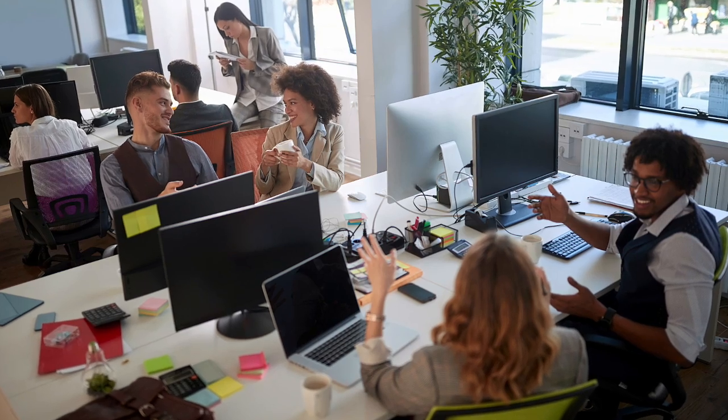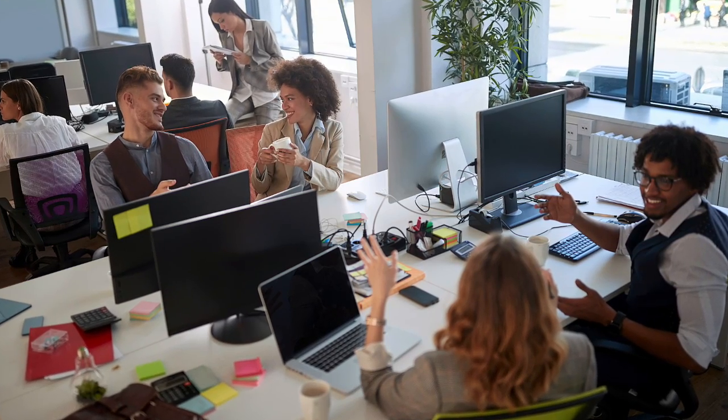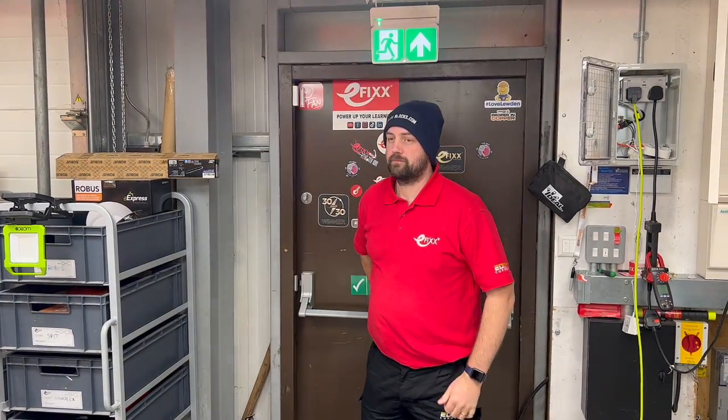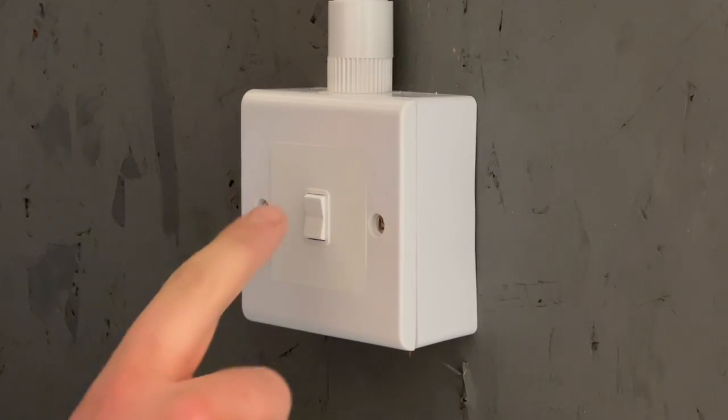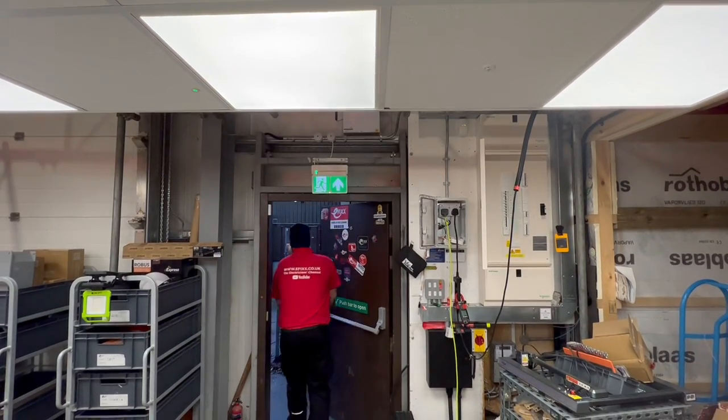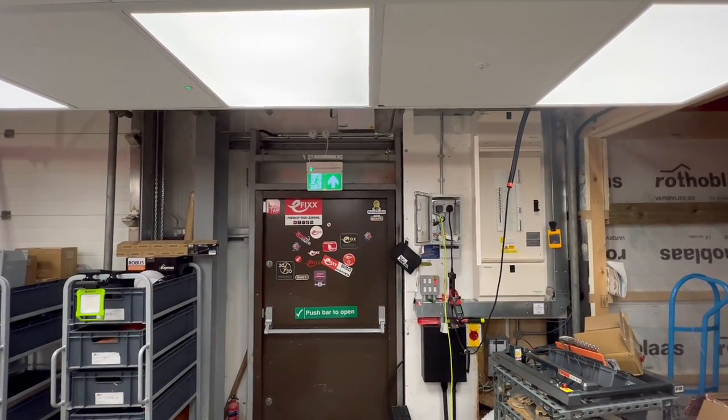Absence is slightly different as it relies upon the room's users to trigger the lights, rather than the sensor that detects if no one is in the room. I've just entered the room and I'm satisfied with the current level of natural light coming through the windows, so I do not require any additional lighting. However, as the day progresses and the amount of daylight decreases, I need a brighter environment to perform my tasks, so I simply turn on the lights using a switch connected to the lighting control system. When I leave the space, the PIR sensor detects this and the lights switch off.